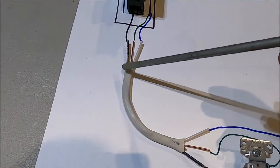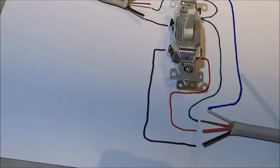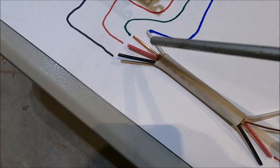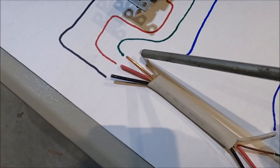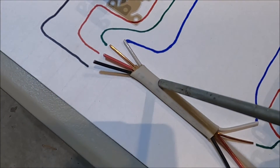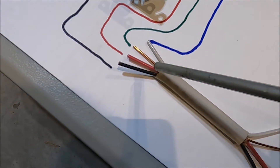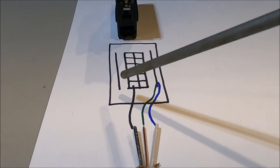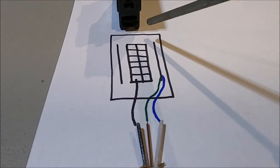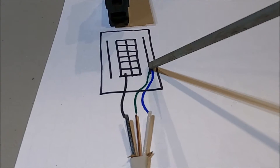This Romex is 14-2, so it has two wires. And as another part of the circuit, just like in the three-way switch, there's a 14-3 with three wires. We need those three wires because we need to use the traveler wire in our circuit. Just like in the other video, you have your panel with all your breakers in the middle and your two bus bars on the side where your neutral and ground wires are connected.